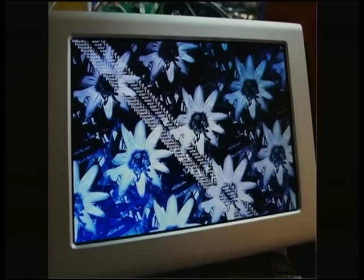The interesting thing is, the frame buffer is not an RGB frame buffer, it's a YUV frame buffer, which sort of fits if you think about the digital camera JPEG display element of it. So all this stuff's going on the luminance channel, and then there's a separate chrominance channel which is adding the blue tinge there. And it's not very useful. It sits there and twirls and looks pretty. There are other things that could be done with it, like it could be a display device for a NAS, or user imagination. But so that's an example of one thing.